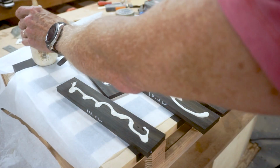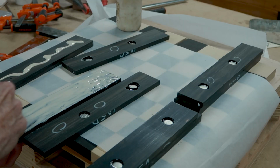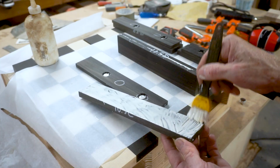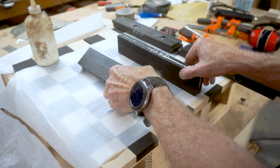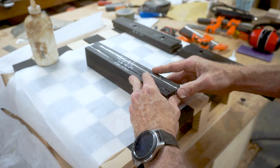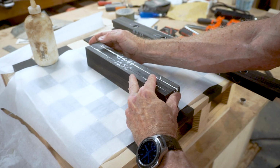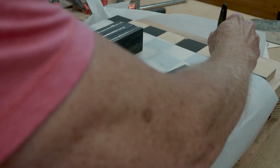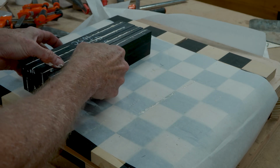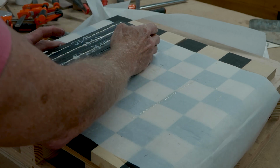Now I'll glue the other half back onto each piece, making sure that I glue the correct pieces together. Then I'll clamp them tightly to minimize any glue line. I'm actually not too concerned about a glue line because it will be hidden with boxwood edge banding that I'll add around the perimeter. But it could be visible at the end of each half if I'm not careful. I'll test the attraction before clamping because this is my last chance to fix it if I got it wrong.